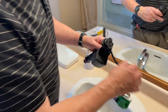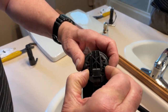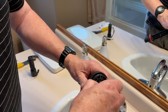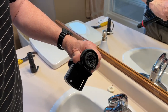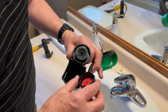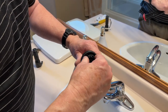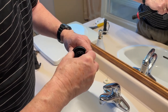We're going to remove the top assembly — it just snaps off. Then we'll remove the float by squeezing those two tabs. This just gives about a quarter turn or less and it removes. We're checking to make sure there's no debris in there, which looks pretty clean. Now this just pulls out — straight pull, no turning — and it'll come out easy peasy.